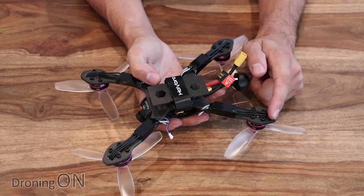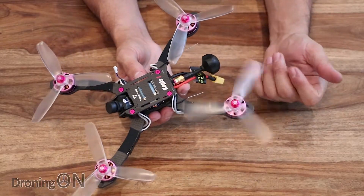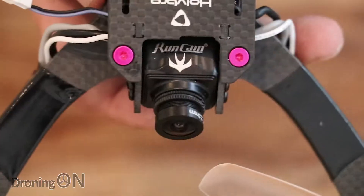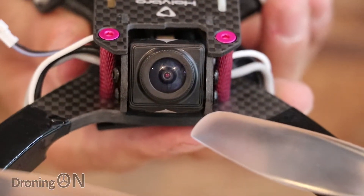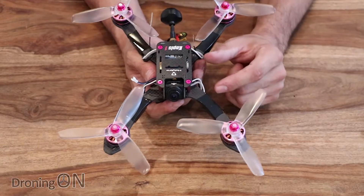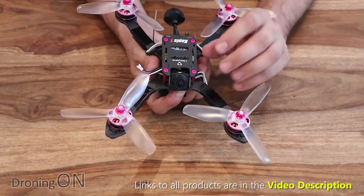The wires from the speed controllers to the motors do feel very soft rubber, which is potentially a weakness. The motors are spinning five-inch three-blade props, and as mentioned you get four spare props in the bag. Looking at the front, we've got a RunCam Swift Mini — not just some cheap off-the-shelf camera but one of the most well-respected cameras in the FPV world. It's a 600 TVL camera with 150-degree FOV via a 2.3mm lens.